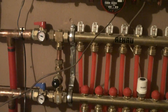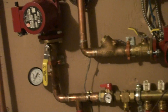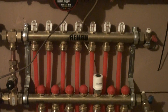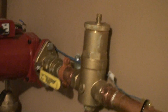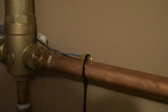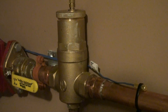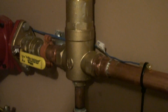There's a pressure bypass there, so if some of the zones shut off and the mix pump is pumping away, it'll bypass some pressure so it doesn't deadhead the pump. Over on this side is an air release. Any air that's in the system passes by this tube here — there's about 18 inches of straight run in front of the air eliminator — and the air bubbles rise to the top of the tube and out the top of that valve.